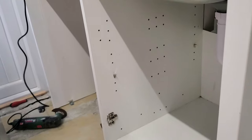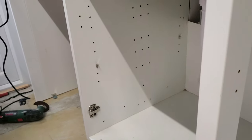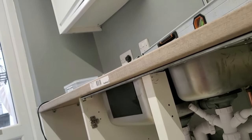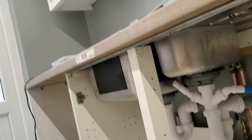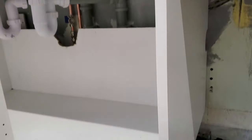This is the adjustable shelving - you get nuts and bolts. I just cut a couple of these brackets off. Sometimes when you drill holes you hit the mortar between the bricks and it doesn't hold - I was able to go up another hole. The advantage of these holes here is there's plenty of them. So that's going to screw on there, I have that leveled off at the back, screw it onto the base unit. Once it's level that way and horizontal that way, put the screws in sideways - she ain't going anywhere. I've lost two sets of hinges, I might take hinges off one of the other cupboards temporarily because I need the doors on to make sure these end panels are on right.